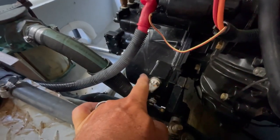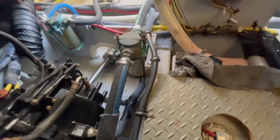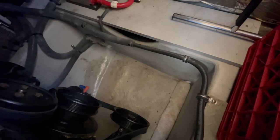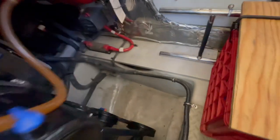On the port motor we're going to mount on the side of the transmission bell housing. Those should be relatively straightforward — sand them off and clean them up. Then we're going to place the other two pucks: one at the stern of the boat on the hull to protect the rear, and one further forward towards the front of the boat in front of the motor to protect that portion of the hull. More than enough surface area is covered with these four pucks.